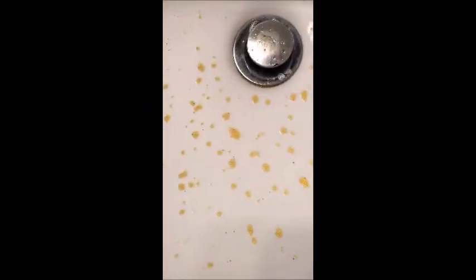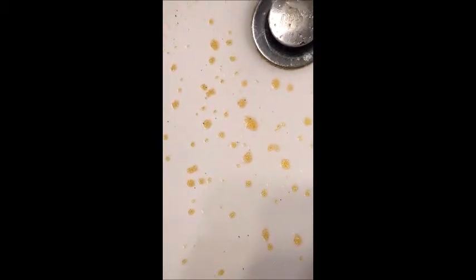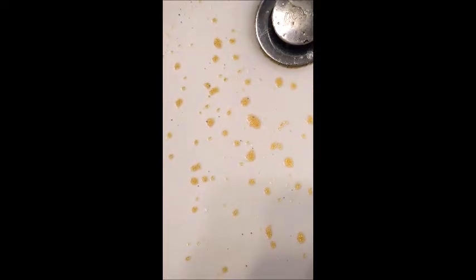I don't know if you're gonna be able to see this, but in the sink came out a whole bunch of little plastic beads, and these are actually the filter media out of the water softener. The screens on all the faucets are plugged up with these millions of tiny beads, which are supposed to be contained inside the water softener.